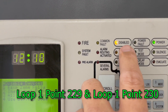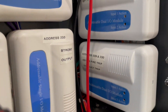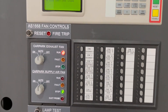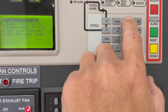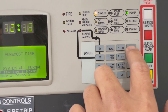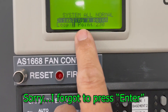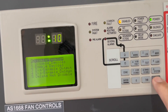See that — the disabled light just came on. The next one to isolate is number 230, avoiding the car park exhaust fan run. We go again: individual points, then loop one, press one, then two, three, zero. Now 230 is disabled. Escape back to the main screen.